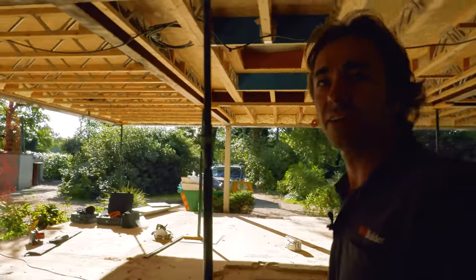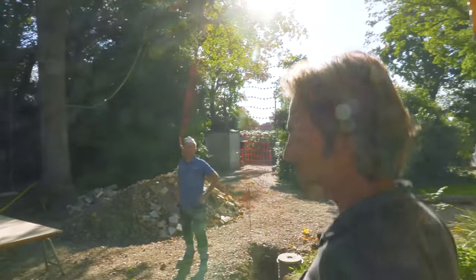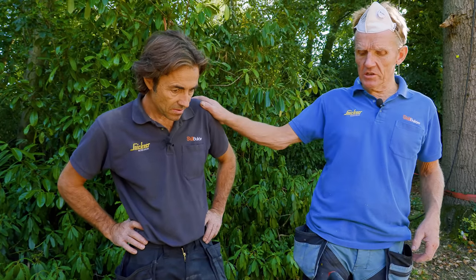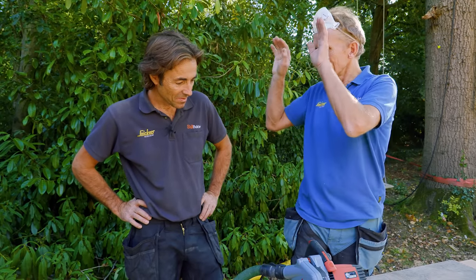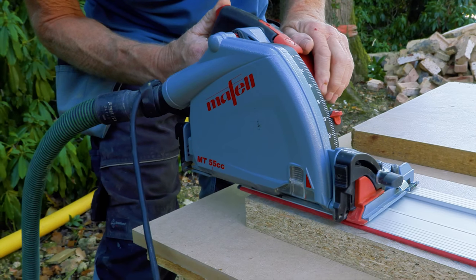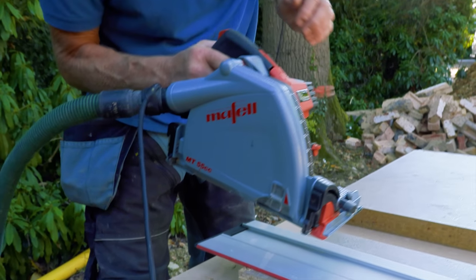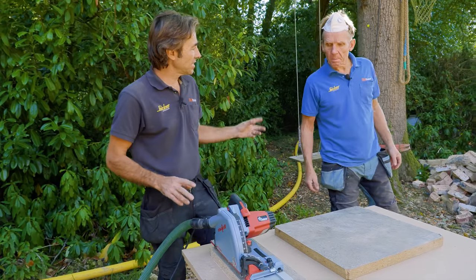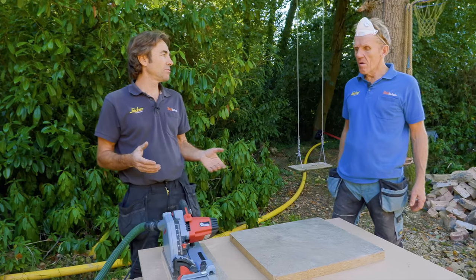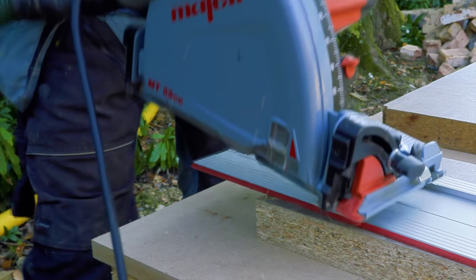I could be losing my loyal following — switching from the big green and black Festool to the red and grey of Mafell. One little warning though: without that front handle, I went to push through and there was nowhere to put my hand — I got a kickback. So you've got to get a hand round the front handle. Or have a backstop set up if you're doing something and don't want it to kick back.